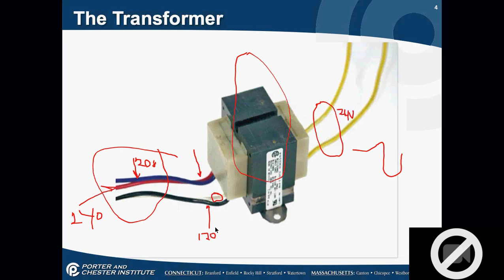It's critical that the wires you don't use have to be capped off individually, because the minute you power this coil, the wires you don't use still have energy on them. If you're using white and black for 120-volt power, you have to cap off the blue and red separately — you cannot put them under one wire nut, or you'll have smoke and fire on the transformer. It will short out the winding. A multi-tap transformer means I can carry one device on my truck and use it in a wide range of situations.